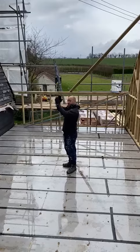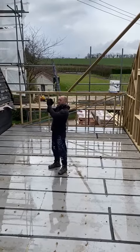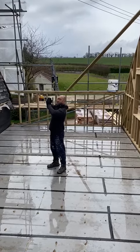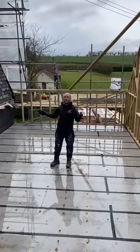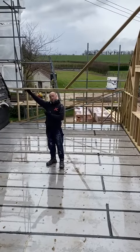Obviously if it's narrow, the ridge comes down. So what you can do is change the pitch to keep the heights the same. You've got a choice of whether it's a less steep or a steeper pitch, how that looks, or maybe you split the difference — changing the pitch to suit the level of the ridge.